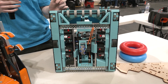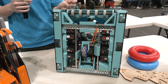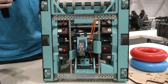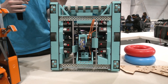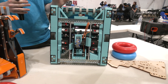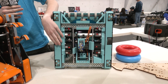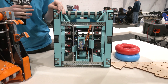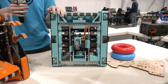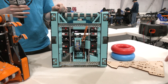Earlier, when you were in a match, you got into a little bit of a tug of war, and you guys were just absolutely dominating the other robot during that. When you're looking at your wheel config, was this the first config you came up with or did you have a lot of ideas? We started off with a 600 RPM drivetrain because we knew we wanted a very fast drivetrain with a pretty heavy robot. We did swap to a mostly flat traction wheel because it helps us with the most grip. We did slots before, but that was really used to displace water, which doesn't really help in VEX. So we stuck with 600 RPM — it works pretty well for us.